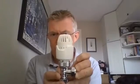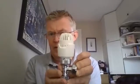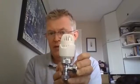So it's a basic valve for this purpose, and also the top fitting is just a hex, and the head locates into the hex. So you've got a choice of 6 positions to put the head. It might not always line up, and I think this one is slightly out, but you can't straighten it because it's due to the position of the hex and the insert. If that's important to you, and it would be to me, I'd upgrade to the RT414 or to the TRV4. But nevertheless, you know, it works. It's a good solid product for the entry level.